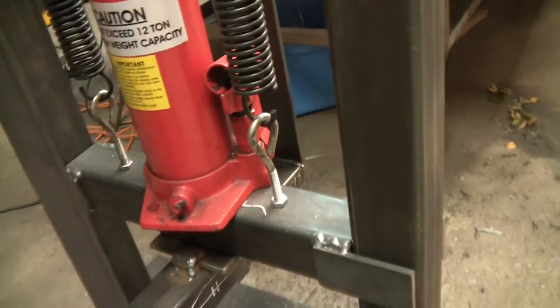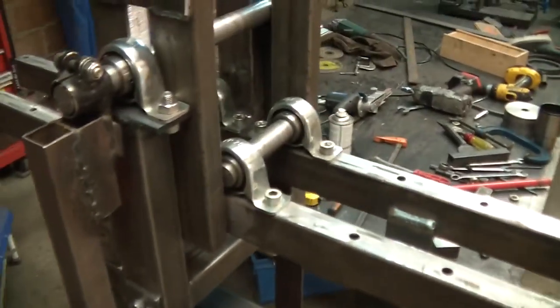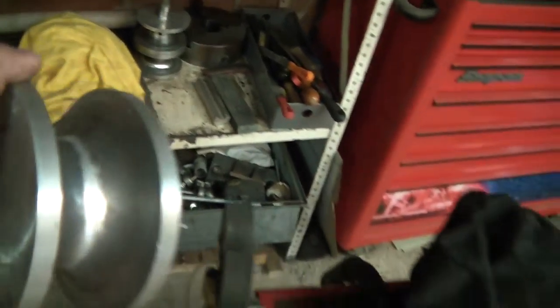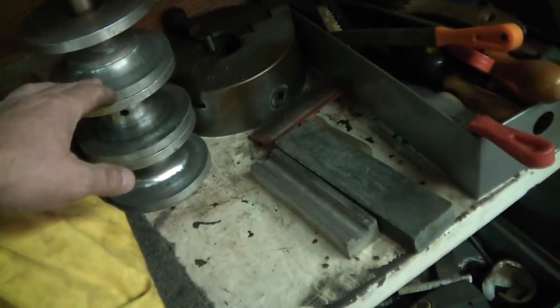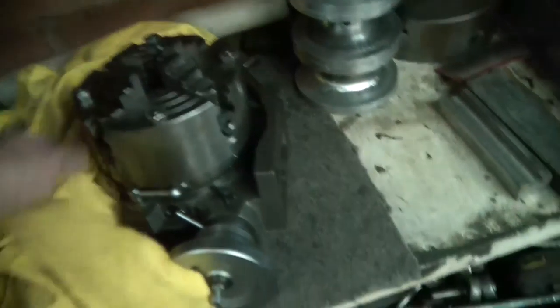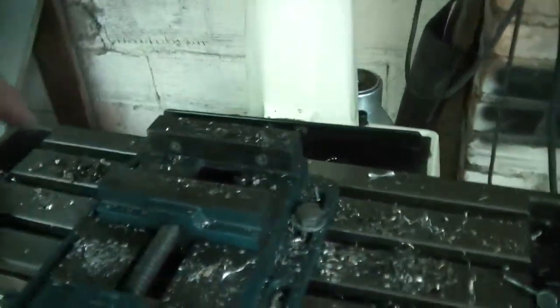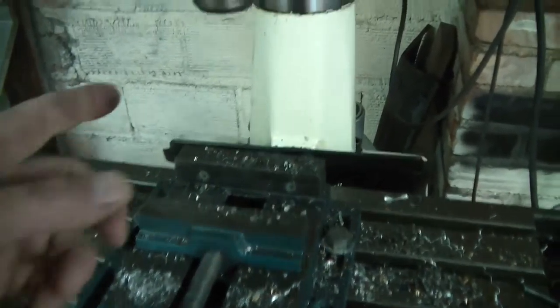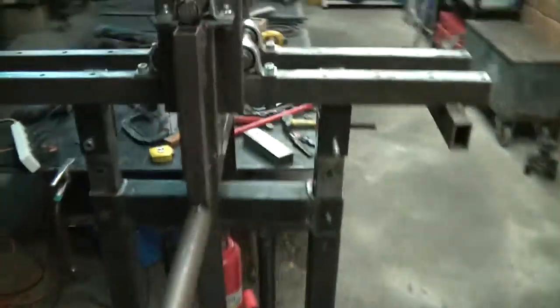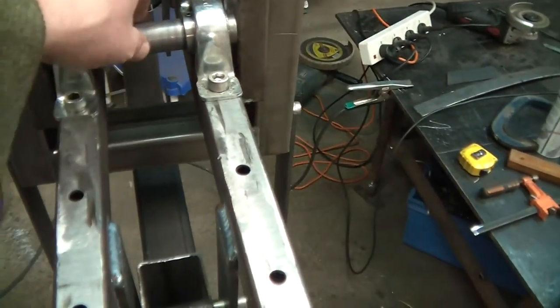Anyway, I had this ring roller that I made a few years ago. I really made it to build my quad bike. I made those using a biscuit cutter - it's like an angle grinder with a biscuit cutter attachment. I stuck it in on a turntable on its side, ran it around with a cordless drill, and just cut into it to make that. That's 50 mil tube.